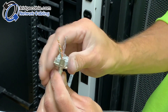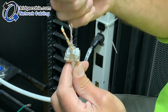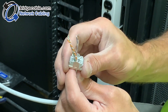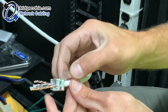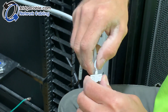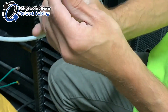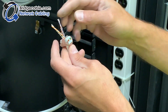Don't go down too far so the cord comes up too high — when you fold it over, it'll be so much harder to get the wires to sit in the teeth. So bring it up a little bit, just enough so it's on the edge of the jacket. Make sure this is still twisted around down below. When I'm done, I tuck the foil in there with the pick.